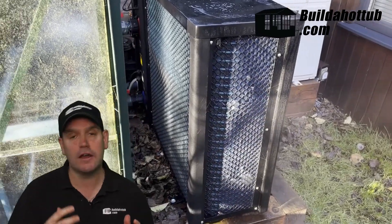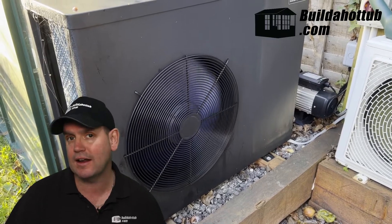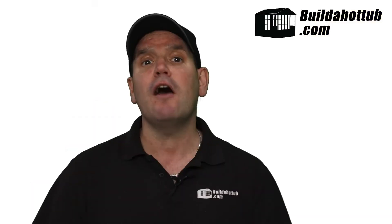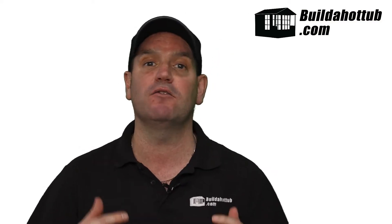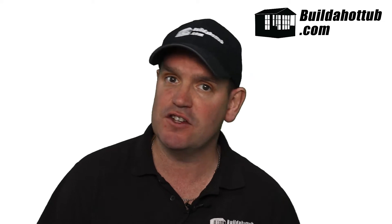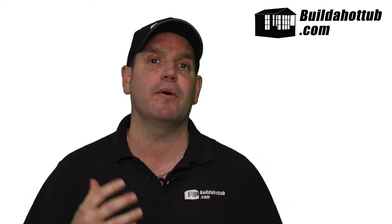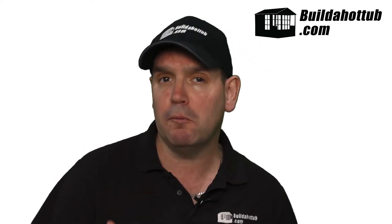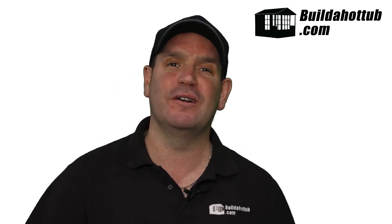This defrost mode on the Comfortline heat pump can only be used every 30 minutes. For me, I used it once — within about two minutes the unit was totally clear of ice, and it didn't ice back up even though the ambient temperatures were still sub-zero. So it's a pretty cool feature. In conclusion, the Comfortline, whilst it is not rated below zero, in my experience it does continue to work. The efficiency will have dropped for sure, which I might be able to see on my smart meter later this week comparing to last week when it was warmer. But what you can't do is leave that ice buildup on the unit, because eventually it will prevent it from working. However, there is that built-in defrosting mechanism — cool to watch, but more importantly, really functional.